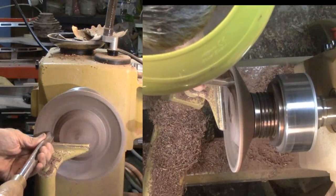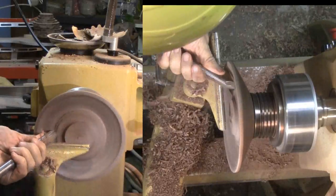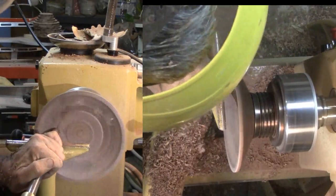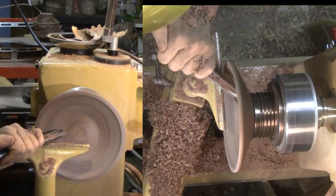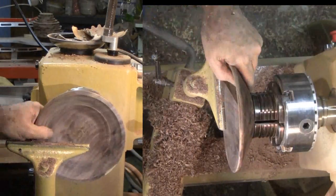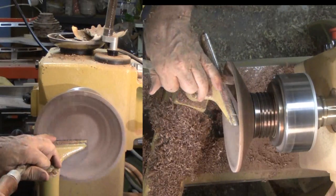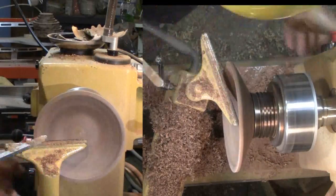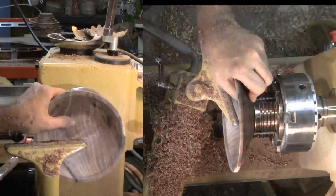For now, with the bottom dish still on the lathe, I'll start hollowing with a gouge. The walnut is very dry and hard — I would not try this with green wood. With wood this dry, the shavings come off the tool too hot for comfort on my hands. That's not a problem with wet wood. I'll finish up with a small round nose scraper. Then sand this half of the interior but not apply oil — I don't want to risk oil interfering with the glue joint that's coming up.